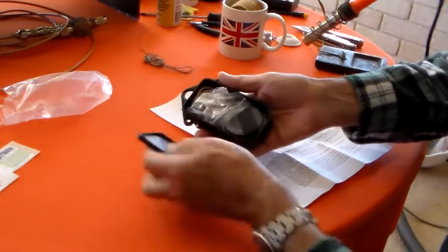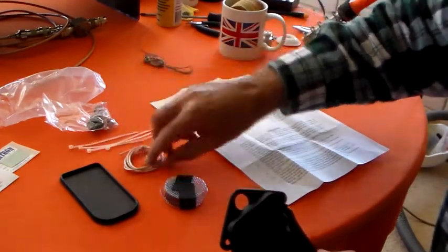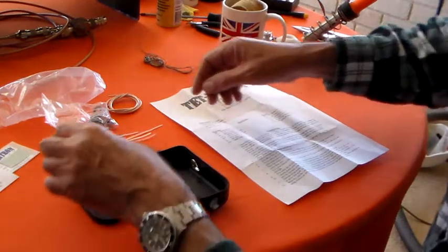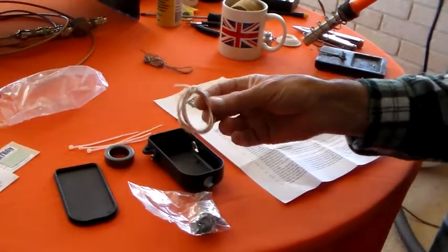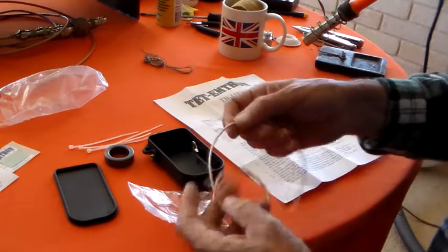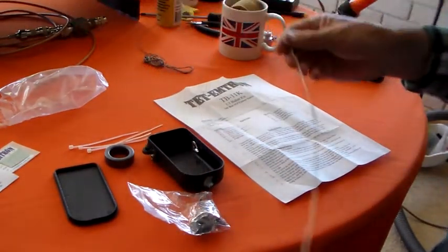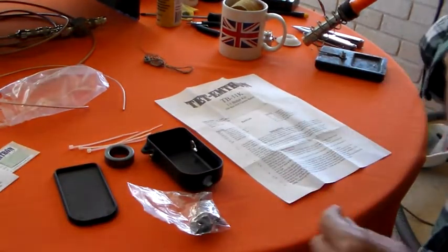So let's see what we've got in here - there's the box. There's a bit of coax; 500 watts is actually going to go through this coax - this is the conductor that's going in our balun. I haven't actually got 500 watts to put through it, but it's probably only for PEP SSB so peak power - it's not going to be there for very long, only instants on peak power, so it's probably okay.